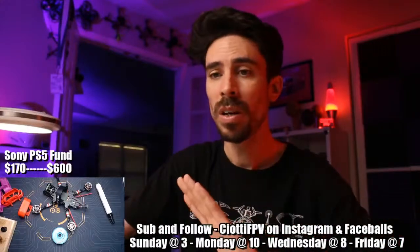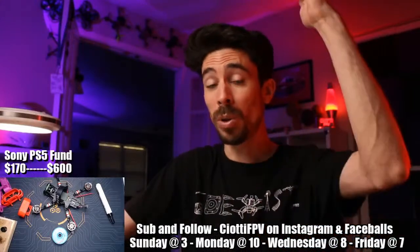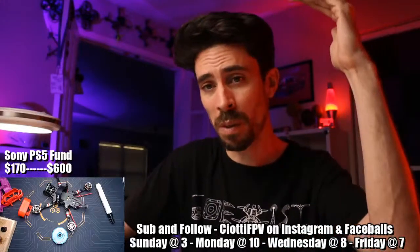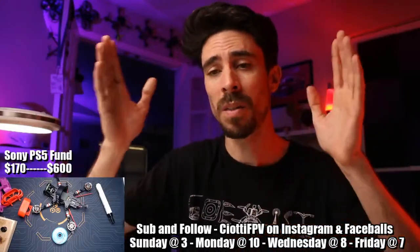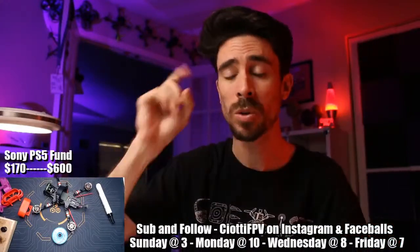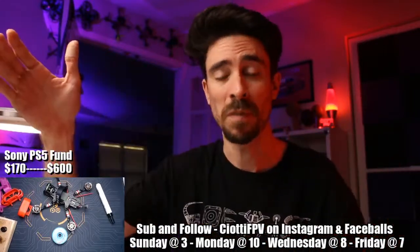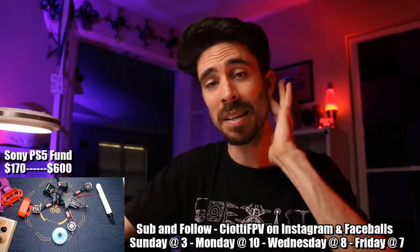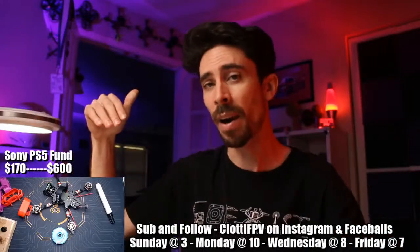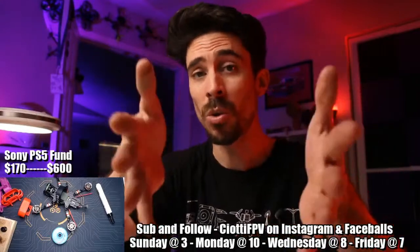Leave it completely alone. You could actually make a really strong argument for pulling all the PIDs down to make the rig fly worse, because the lower the PIDs, the more headroom you have in the tune, the more you can pound on your motors, your propellers, your entire setup, and it'll just keep flying. And it'll also, like I said before, show you when you're putting the rig into dirty air. And the less often you put the rig into dirty air, the better. That's the part that's on you as a pilot.